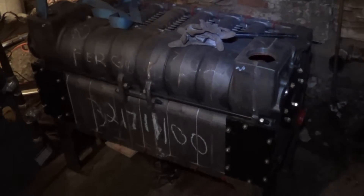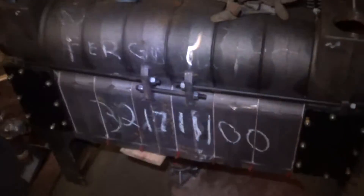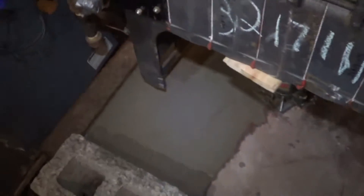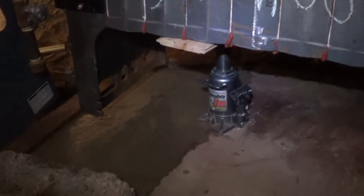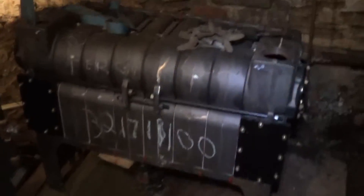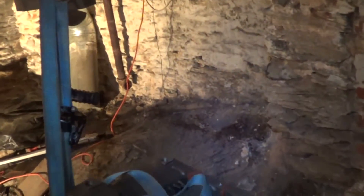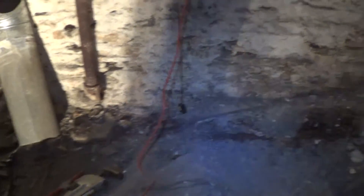We got the new boiler in. It came in in two pieces where it split right here, and then we used a rebuild kit to put it together. Fixed the slab here — before it was just sitting on a block and it was going off level. Now put some rebar in, put some cement. That's why I got the boiler up in the air right now — this is day two. I'm going to let it sit and let that cement dry, and we'll have a nice good foundation, which is important on steam boilers. And we got some corroded pipe there — I was able to break that off. So we're ready, getting some new pipe threaded for the condensate, which runs back to the boiler. So tomorrow we start putting the piping together.